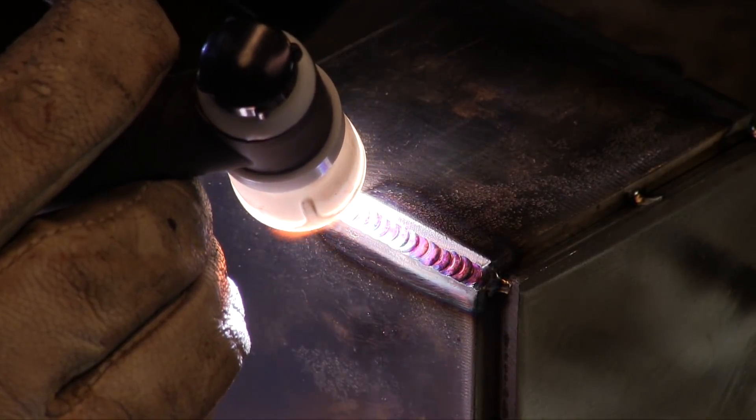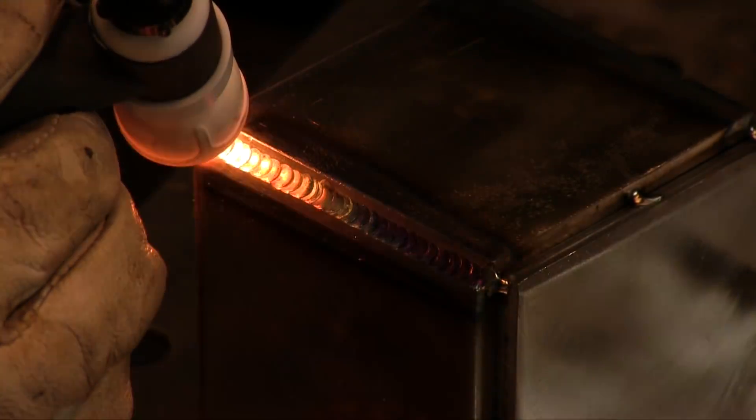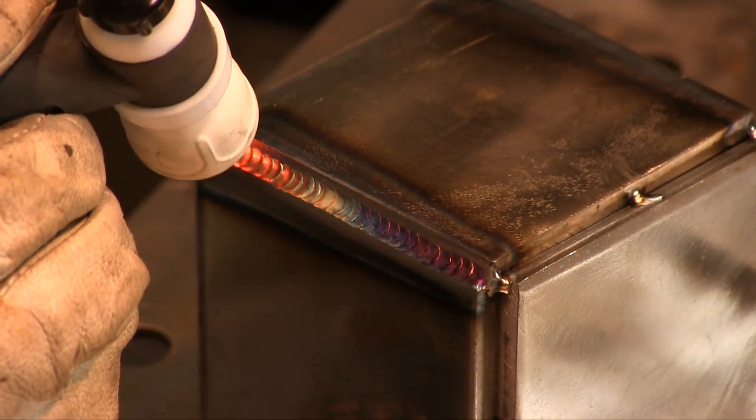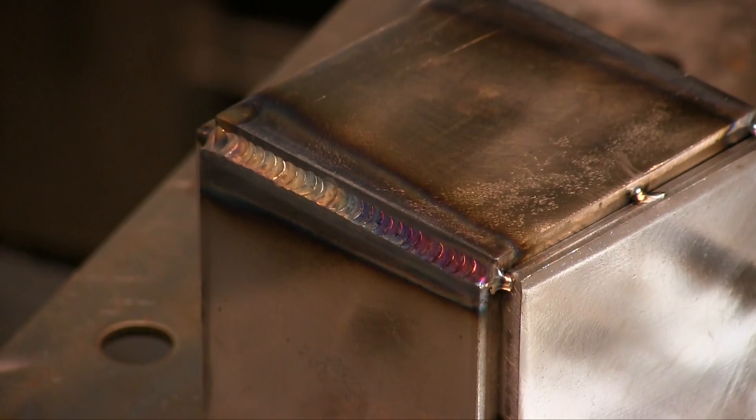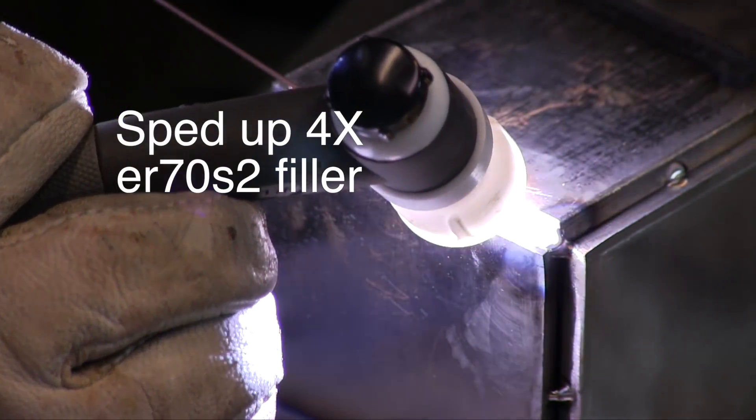People ask a lot: how do you hold a tight arc without crapping up the electrode all the time? If you pay close attention, I'm pulling the arc length back just a little bit while I dip the rod — just a little bit. It's subtle, but that keeps me from having to sharpen a lot of electrodes and still hold a tight arc. I'm also trying to get by with just enough heat to flow that puddle, stepping out a little bit further between dabs. You can see the heat tint is much less than the previous weld — and even though discoloration isn't a hundred percent indicator of heat affected zone, it is a way of gauging it. The color is better on that one — a little less heat tint.